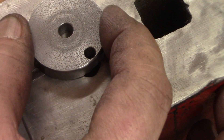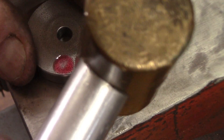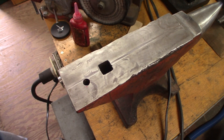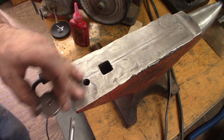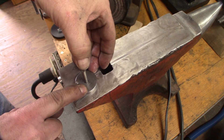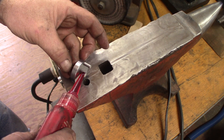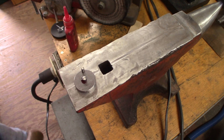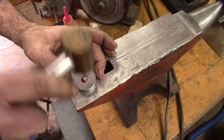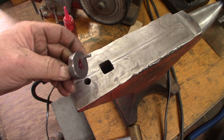The heavy part has to be done on the anvil. We're going to take this crank pin, put a little Loctite on it, and drive her in. That was tough — good thing I had an anvil! Now for the crankshaft, we're going to slip this in. This has to go the opposite direction. It just fits — just fits. We push that there and that there, and that knurl has made it about 0.5 thousandths larger. Nice, nice tight fit.